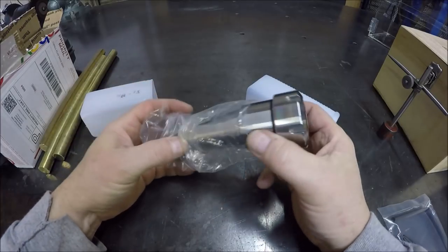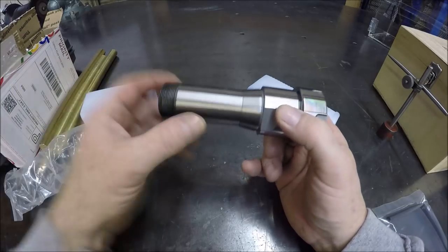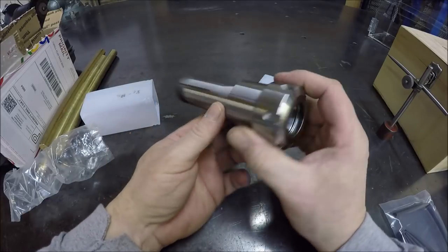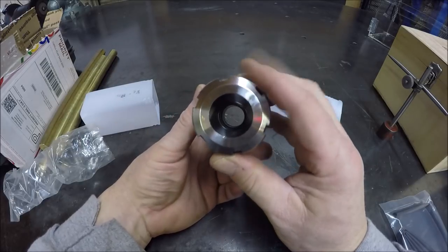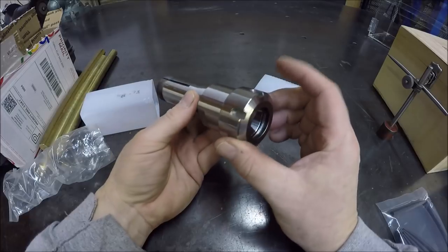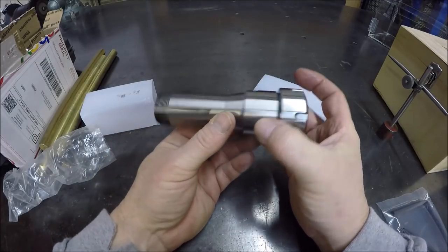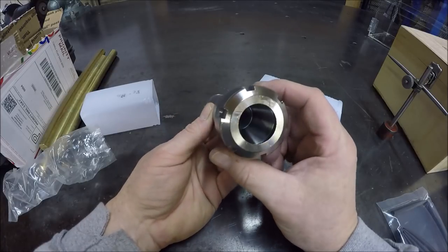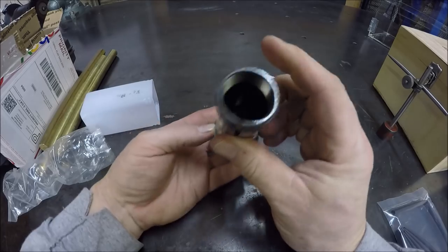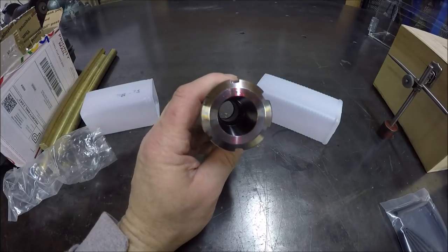You guys know from a previous mail call I picked up an ER-32 collet set with Morse Taper 3 so I can use it in the tailstock. I figured why not get an adapter to go to a 5C — it gives me a little more versatility with the ER-32 collets since they have a better range. If I need an odd fractional size, I don't have to order the collet because I can use the ER-32. This gives me the option to use it in either the 5C collet chuck in the lathe or in one of the collet blocks. It's an import from China, took about three weeks — I don't know what the runout is going to be, but first impressions look good.